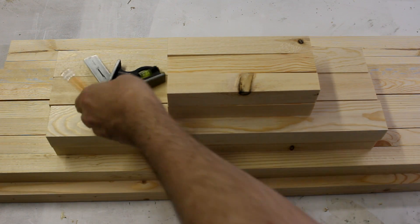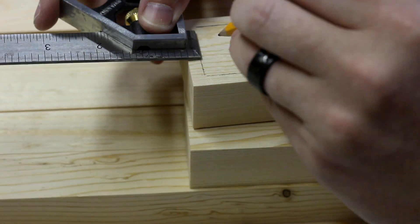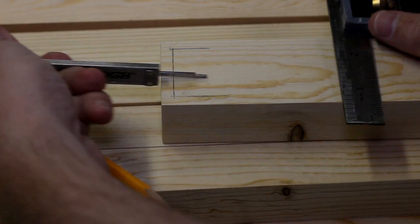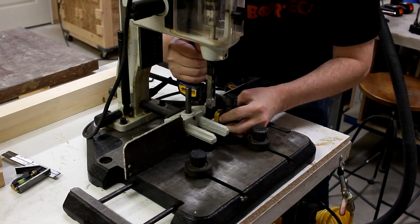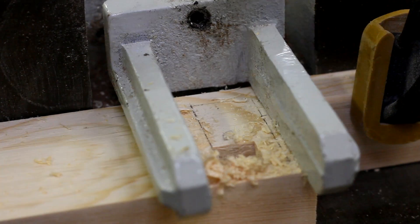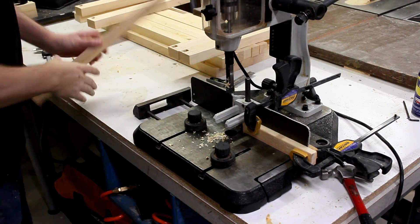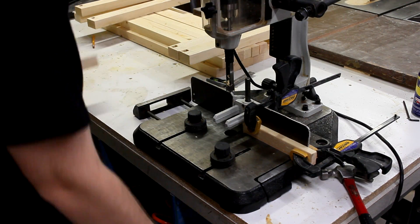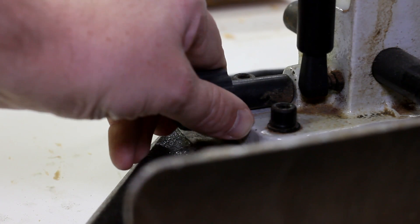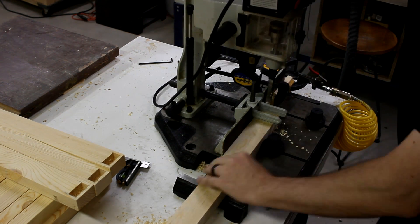Now it was time to start laying out where the mortises were to go. To simplify things, I just set my combination square at one quarter inch and drew on three of the sides for each mortise. Then to draw on the final side, I used my calipers to space it out appropriately and just slid the square right up to it. Now to cut these mortises, you could use a variety of methods, but I'm going to cheat and use my benchtop mortiser. It's basically a drill press that squeaks a lot and magically drills square holes. I set up a stop lock, got things all lined up, and then went through and punched a hole in each mortise section. When I needed to adjust it for the next hole, I just loosened up the locking screw, adjusted the fence, and locked it back down. Overall, it made very short work of cutting the mortises, and it sure beats having to chisel them all out by hand.